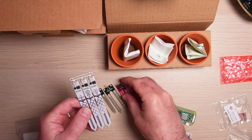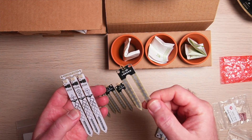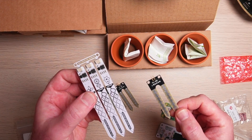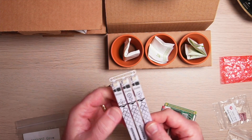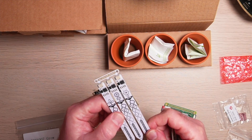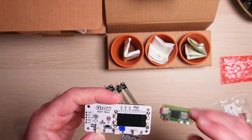According to the Pimoroni website, these are resistive moisture sensors and the Pimoroni ones are capacitive moisture sensors. The difference is that resistive sensors will eventually corrode — the moisture in the soil will actually etch away at the electrodes — whereas the capacitive ones are completely sealed and therefore won't be susceptible to erosion and corrosion.